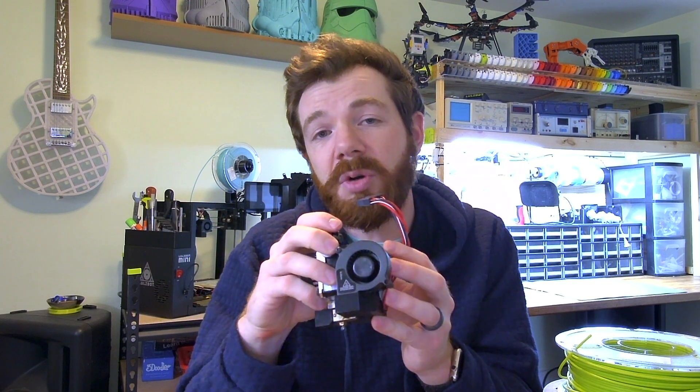A popular method if you really want to do a lot of multicolor printing is through something like the Prusa multi-material mod or a Palette, which allows a computer system to automatically change filaments into your single extruder. Another super popular method — and actually my preferred method — is to 3D print the separate parts in separate materials and then assemble them in post-processing.